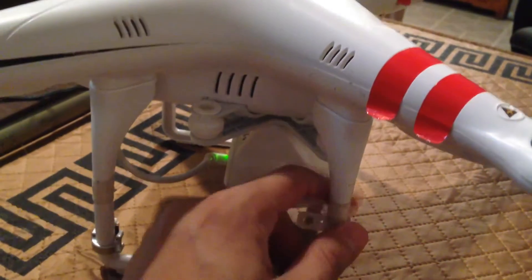If you ever needed to replace the horn in the middle that the servo plugs into, you can take any servo horn, cut it to size, and put it in there — any servo horn that accommodates the nut that it uses.